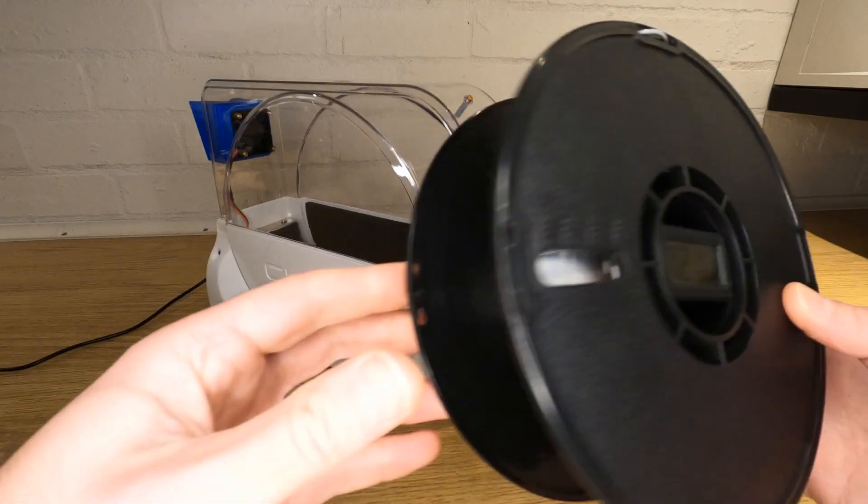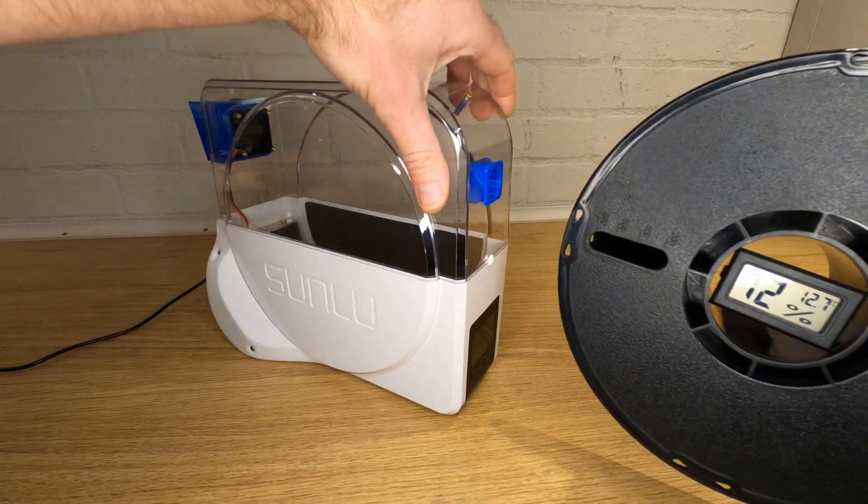As part of another video testing wet filament, I found that putting the timer back to 2 minutes on and 30 minutes off was actually pretty good for keeping the humidity as low as possible and the temperature as high as possible inside the box. So we now have the ability to run the fan at the speed we want for the amount of time we want, and we also have good airflow through the box — meaning we don't have to run the fan as long to get the damp air out, which in turn helps to keep the heat up.